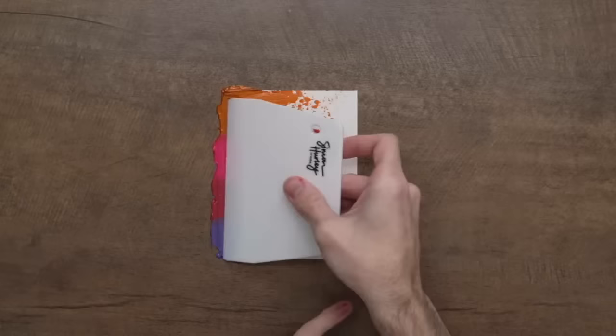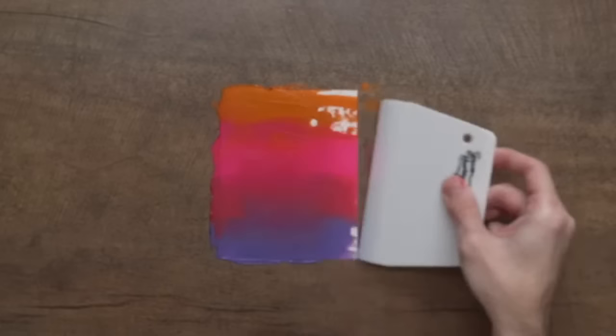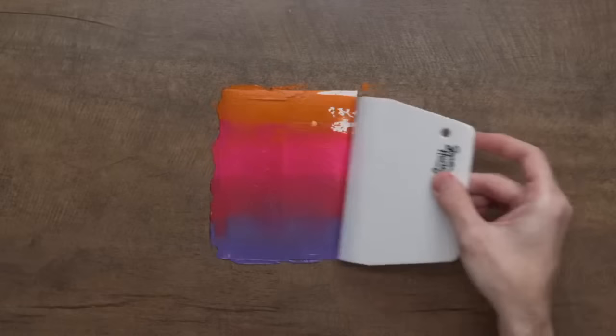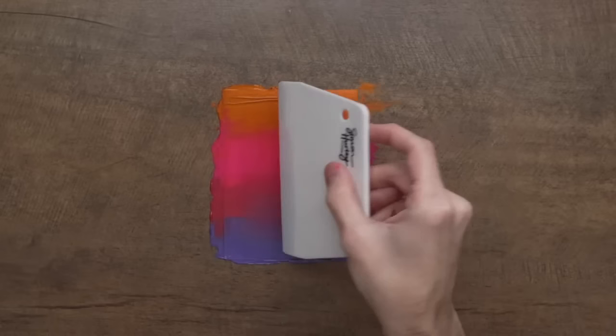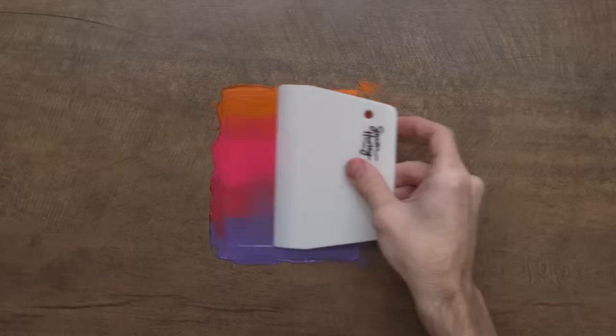Some people use the scraper tool and just keep swiping like this, but you're not really getting any more paste down onto the surface even though you still have a lot of paste on the back. The reason is because if you're doing it at this angle, you're not going to distribute any more of that paste. But when you push it down at more of a downward angle, you're going to distribute all that paste out onto the surface, which helps spread it more evenly. That's a really great tip — play with the different ways you hold this tool. If you want to scrape more off the surface, use it at more of an upward angle.